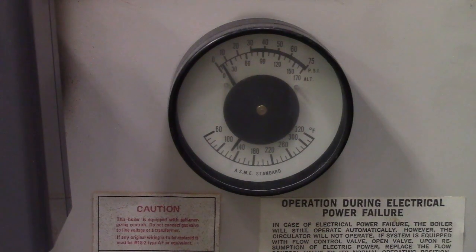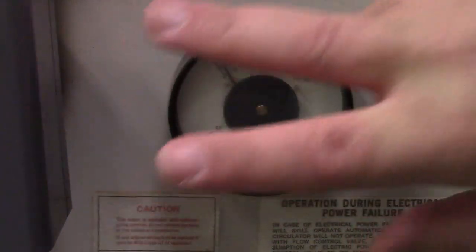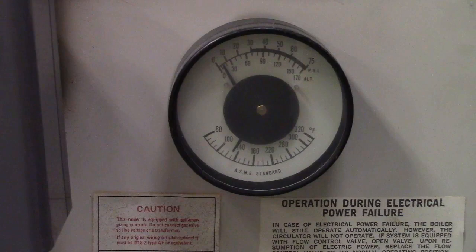I'm currently feeling the vent hood on the exhaust, which goes up the chimney. And while I feel warmth, I don't really feel much of a draft coming in, which is exactly what you want. What you do, lick right between your fingers and hold it. And if you feel coolness, then that means that the air is coming down the chimney. I do not feel that, which is great.